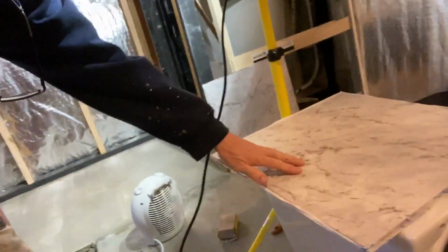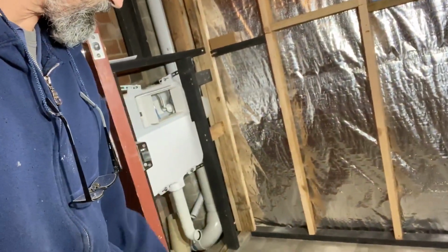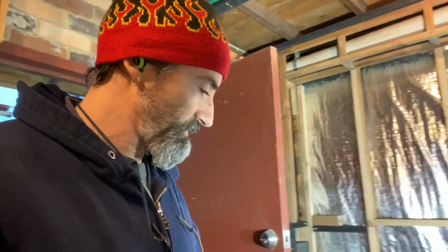First day I'm really up and about with my back in a long time, and I came down to get these tiles, just a vinyl adhesive tile set up in the bathroom area. I've moved the toilet out, moved the basin out so that I can get this ready. And there was a thing in the back of my head just going, I wonder if I need to prep the floor just a little bit more, because I used Bondcrete in the concrete mix so that it was a nice stiff and sticky mix. But then, you know, concrete really needs to be sealed, so I've just sealed the surface.